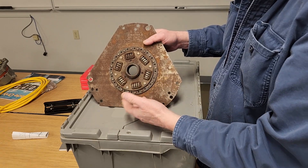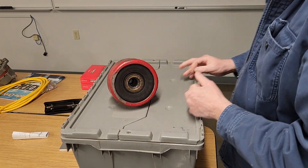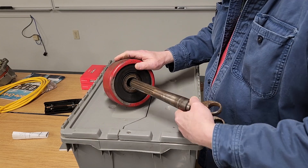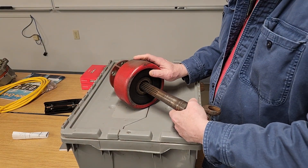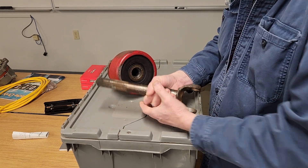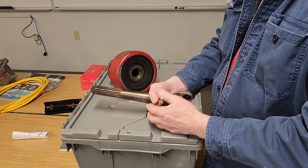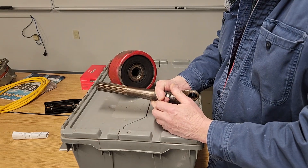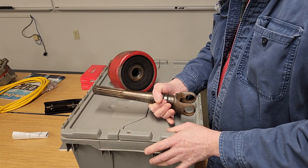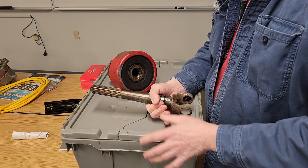So that's a drive plate in an inboard engine versus a drive coupler in a stern drive boat. Here is the input yoke shaft — that goes into the coupler like this. What's in the transom assembly: when you put the drive on, there's a very large bearing called the gimbal bearing that rides right about here on the shaft and supports it. That bearing is pressed into the transom assembly — it can't move up, down, left, or right. It can be turned slightly in a ball-and-socket kind of way, and of course it can spin.